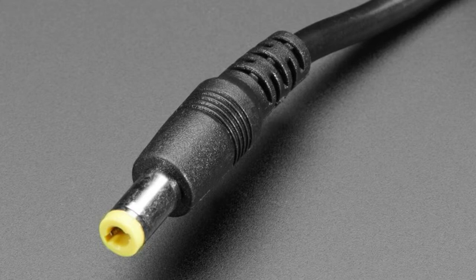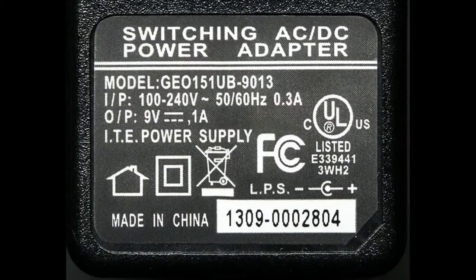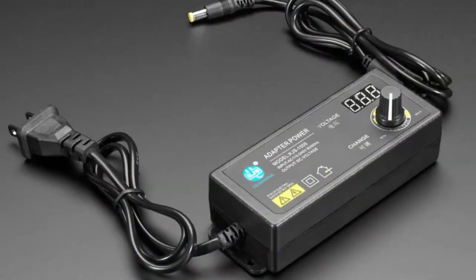I'm sure you have tons of these types of power adapters at home. They're called wall warts because they're a little bit warty. You plug them in and you get that 2.1 / 5.5 mm jack on the end. But the thing that's really annoying is every power adapter is slightly different — this one for example is 9 volt 1 amp. Some are going to be 5 volts 2 amps, some are 20 volts half an amp. They can be any voltage, almost any current limiting amount. Some are AC only, some are DC output, some are positive tip, some are negative tip. There's one connector but it's used for a variety of different voltages and current capabilities.